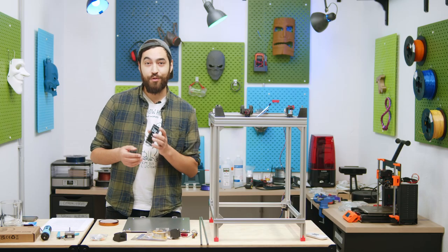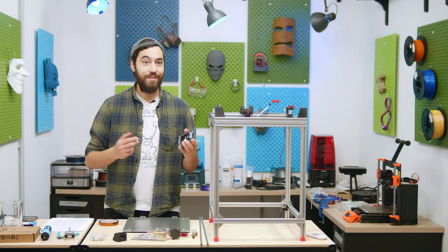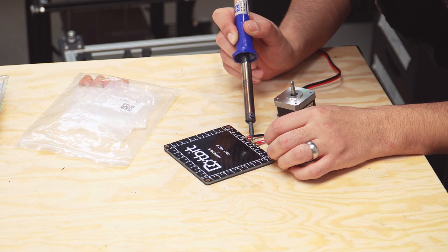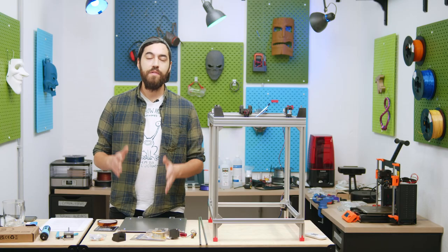The heater connections might be troubling for some people — we just have cables and connections — so we're going to have to do some soldering. I hate soldering, I'm a little sensitive about this so be kind. As for the heater cables, keep in mind which cables you're using: higher power beds will require more heavy duty cabling and smaller beds less so.